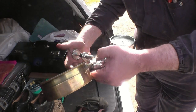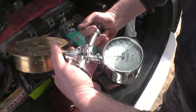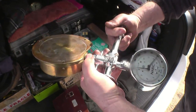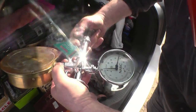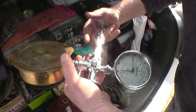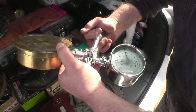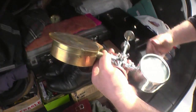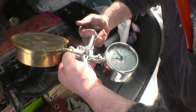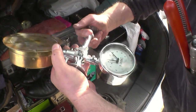Up to 50 pounds... spot on, look. Yep. Up to 100... 100, 100, 100. 150 next... spot on, yep. Up to another 100... spot on again. Looks like a good gauge. It's not bad. 255 we want, don't we? Working pressure.